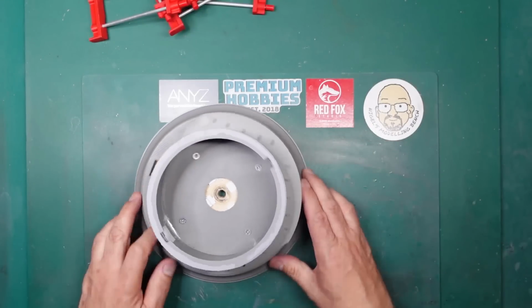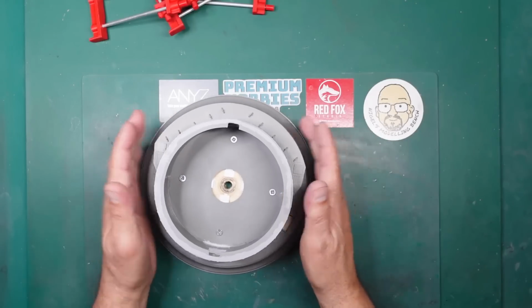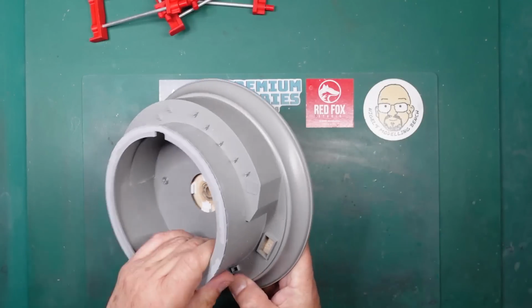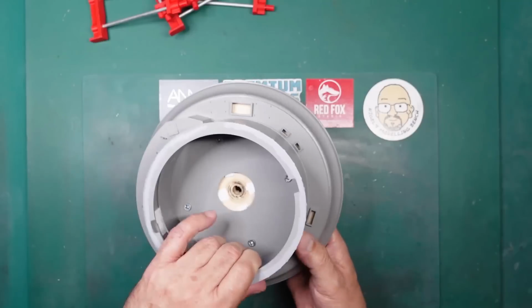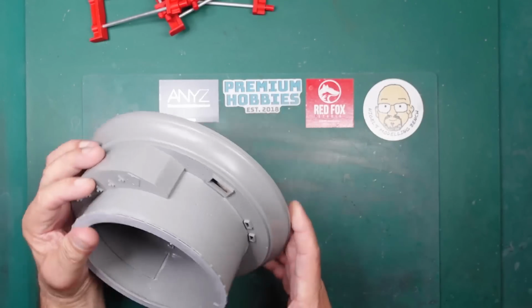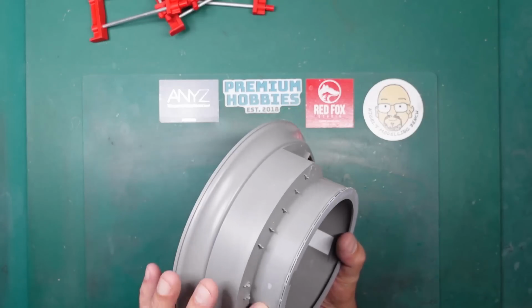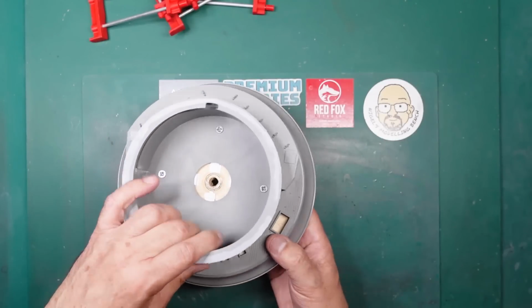And the answer is yes. We've got a nice flat base. We've got a lovely seam in there because we've glued it after we've clamped it. My regular followers will know, I always clamp before you glue it, then you don't get glue oozing out. Unless you want glue oozing out to act as a filler to sand back. But there we go. So happy with how that's looking.